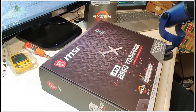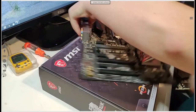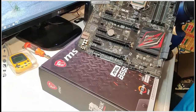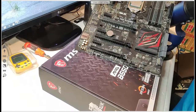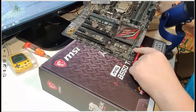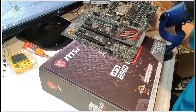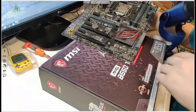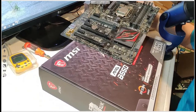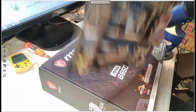The i7 is in there — so in there is my i7. I'm looking for the M.2, but there's a giant hole in the board — that might become a YouTube video of me fixing that. Basically I'd need to de-solder one of these and solder it here, and that will fix this board. Would that have been much cheaper than spending $410.68 on an AMD Ryzen 5 5600 and an MSI B550 Tomahawk? Oh yeah, that would have been way cheaper.